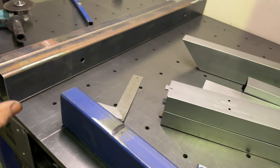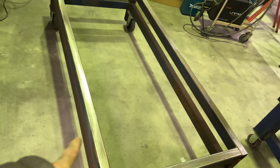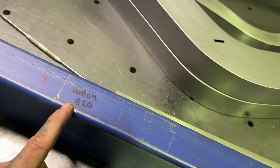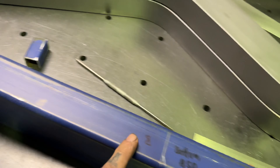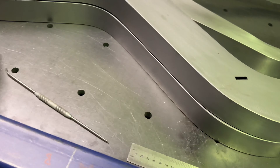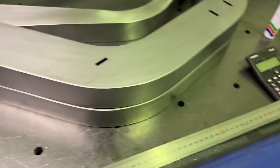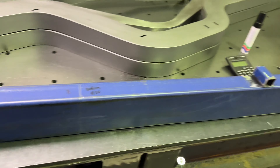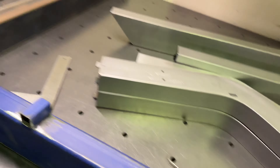These are the stringers - one, two, and three. The centerline measurement you're looking at here is 850, which is the width of the table outside to outside. So I've done 850 divided by 2, which is 425, and that brings us to that center measurement there. I've cut these little bits of RHS and they sit like so - one on either side. They weld on like that and then this flips over because it's on the bottom and locates on the table nice and square.